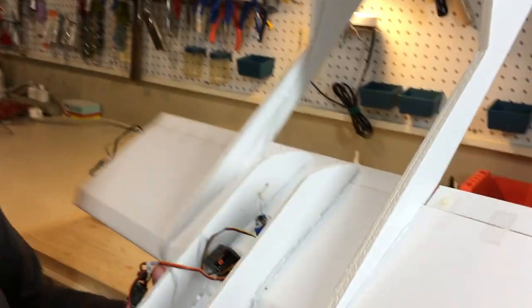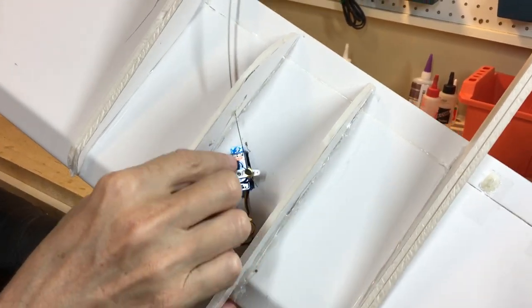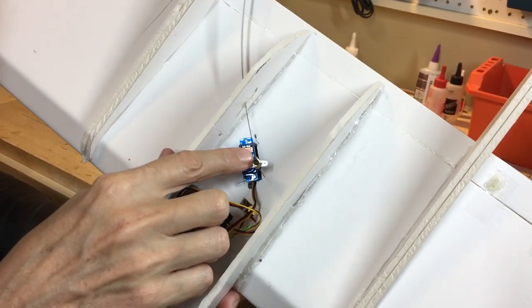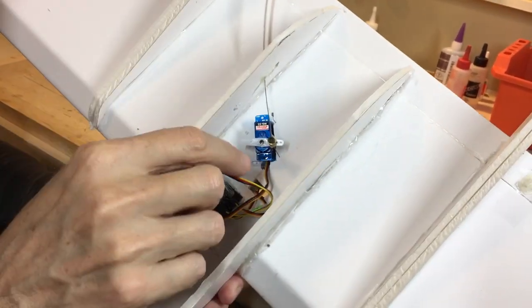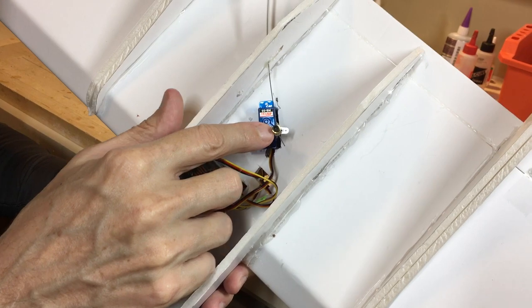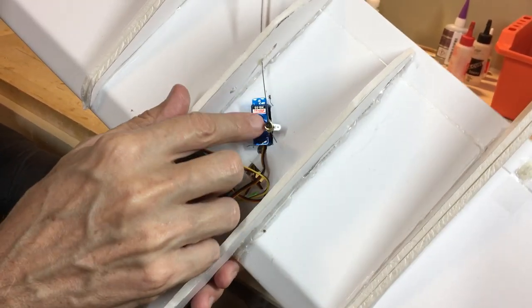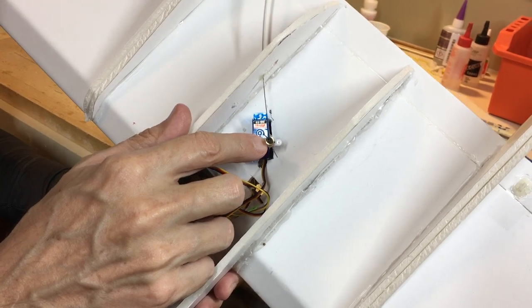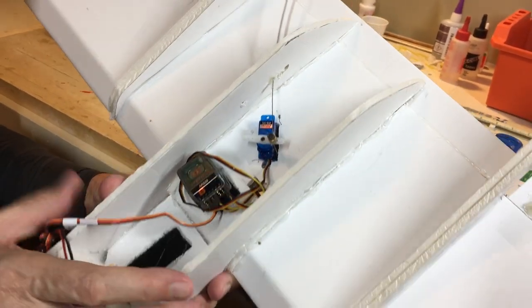One thing I want to point out, you'll see these holders here for the wire. You can screw this and adjust the wire in and out. The problem with this very thin wire to allow it to have the tight radius of bending is the wire does not provide a good surface area for that screw to hold it tight. You can tighten the screw pretty tight and the wire can slip out. So what I did was I put some epoxy in there to hold it into place, just to keep that in mind.